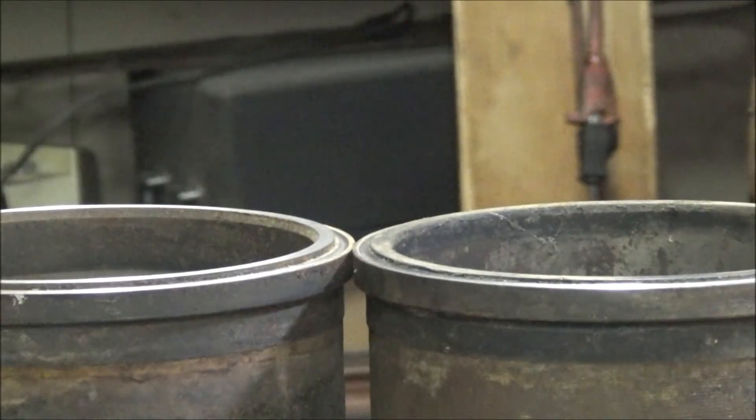Hopefully you can see that there - I was wondering why my measurements weren't coming out right. One of these liners is a mix and match, apparently what I was provided. It's got the taller fire dam; it must be out of a naturally aspirated engine. Still the same displacement, but they use a different head gasket on them so the fire dam is a different height. I'll trim that one down to make it match the rest of them because this is going on a turbo motor with the short gasket, so I'll get that one cut to match the others.